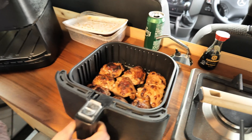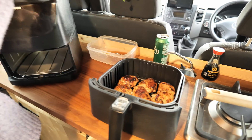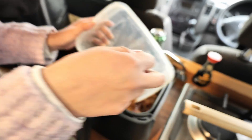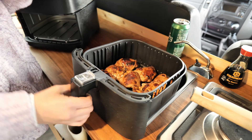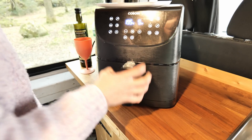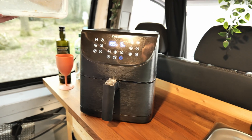As for cooking, we are using an air fryer. The problem is that this air fryer uses about 1,600 watts, which is too big to run from this battery — and I only have a 1,000 watt inverter anyway. So instead, we're using power from the power station we have under the bed to run the air fryer, and we'll recharge the power station from the LiTime battery after we're done cooking. We're basically just borrowing power from the power station.